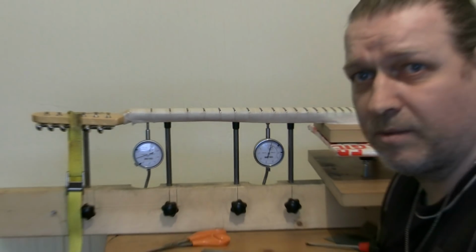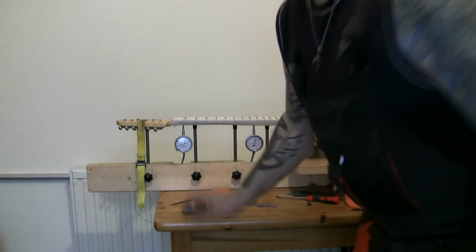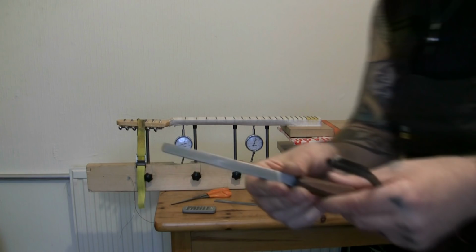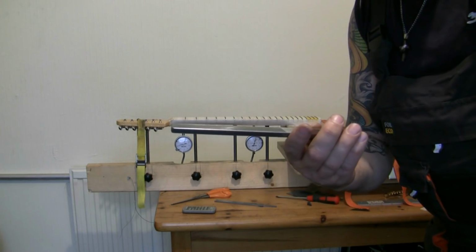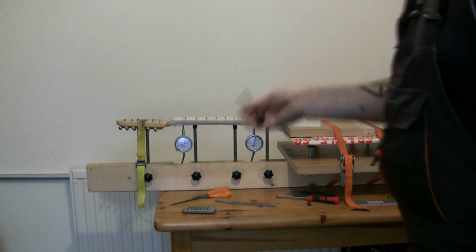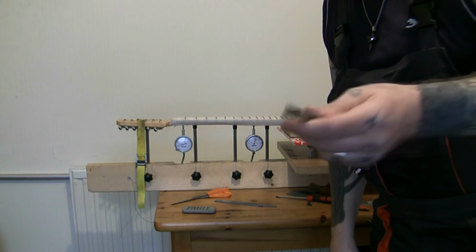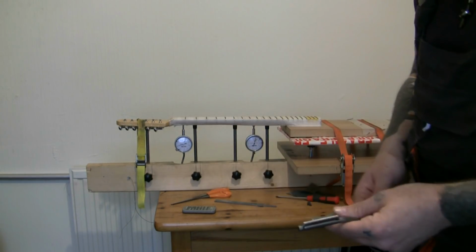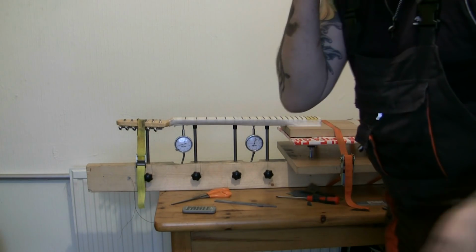I'm going to go get the crowning file. I'm going to use my 3-edge file, which I'm going to just grab just now. One I got from Crimson Guitars a couple of years ago. Been a great piece of kit this has for, I think it was 17, 18 quid or something. We're at 20 odd quid now. Going to do the main work with that, bring the edges in, you know how I do it, I bring it in and I roll over as I come in. I'm going to finish off with my crowning file. Once I've done that, I'm going to go across with my diamond crowning file, which is in my neck fretwork box over there.